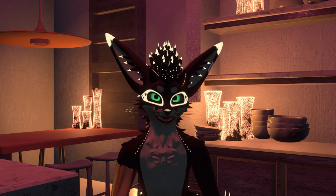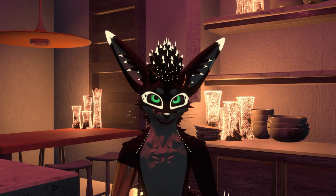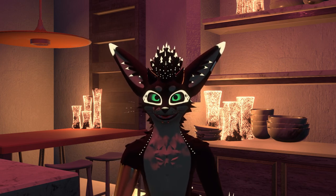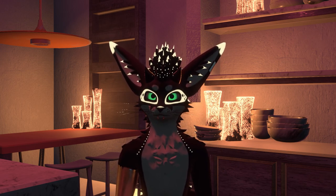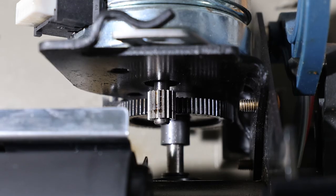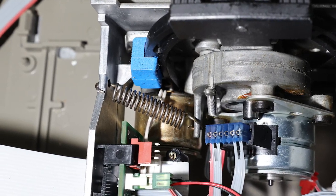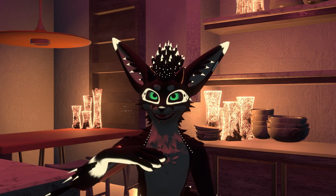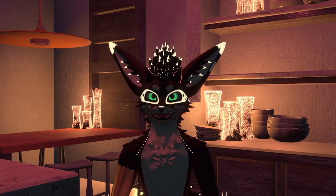I think that'd be a good thing to do. And maybe with a little poking around, I could find how it actually indexes these wheels and figure out what they are. Another project that I wanted to do: these typewriters are more like modern 3D printers than they are typewriters, really. They have four stepper motors inside of them, and at least two solenoids. One drives the hammer into the type wheel and ribbon and paper, and somehow it's able to index the ribbons into three discrete positions. I'm actually not sure at all how that works, but it does it somehow.